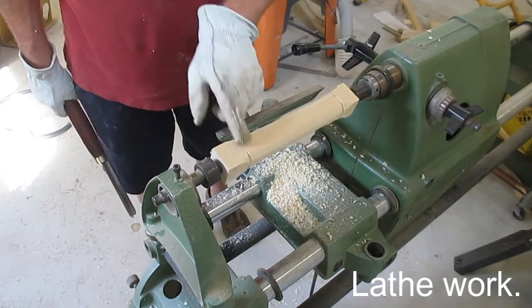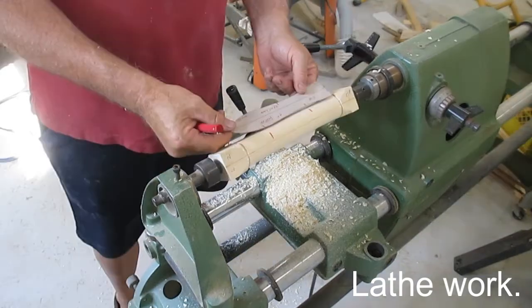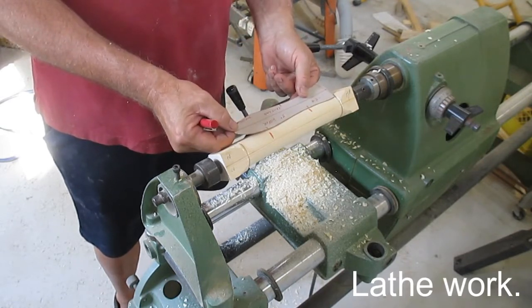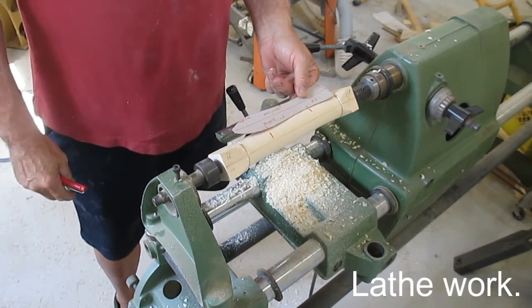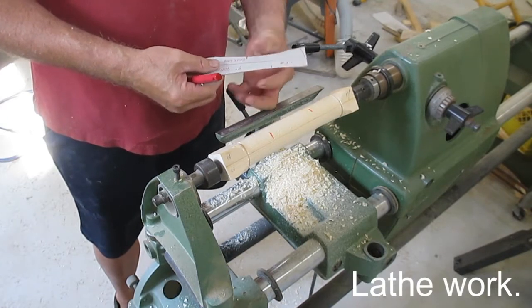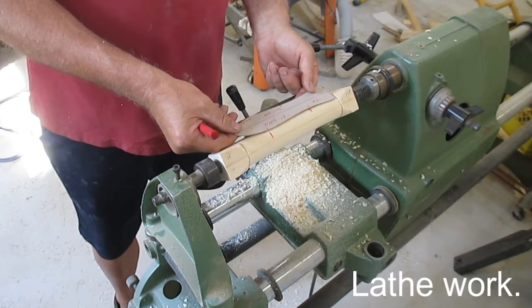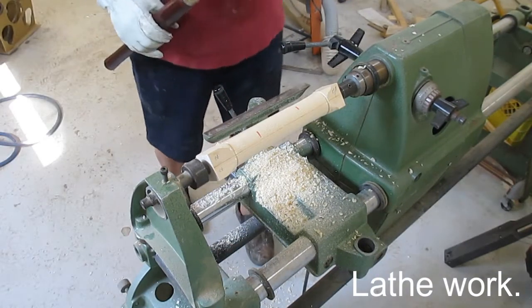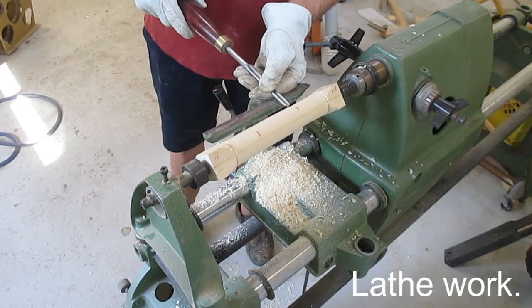I stole a little bit of a flat spot there, so I'm going to try and get rid of that and then start measuring. I've used my layout tool and marked a high point and a low point. What I'll do is try to get down to this diameter here — a little higher maybe — and then make the contour. Then I can make any fine tuning with the files and sandpaper. I'm going to use a smaller gouge and start reducing this area where it's the smallest.